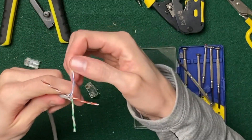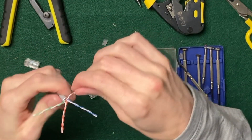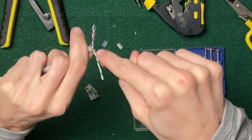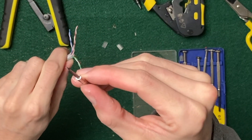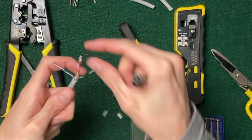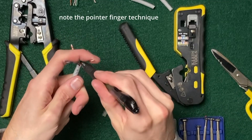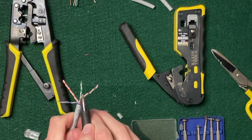There's a really great trick, and this is key for having an easy time putting the jack on — knowing how to zip these out. Hold the cable right here, grab the end, and just circle it like this. That's going to open up the bottom of the cable and create a little gap. You can use a small flathead screwdriver to zip it out, or more likely you'll have a pen. Hold the cable, get your pointer finger out there, push the pen into that gap, and just lean into it and zip it out.